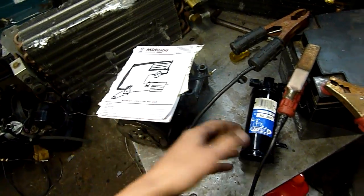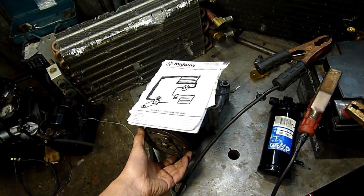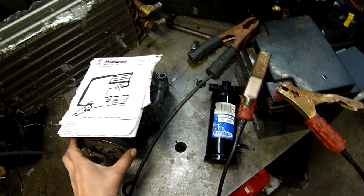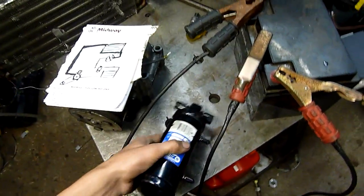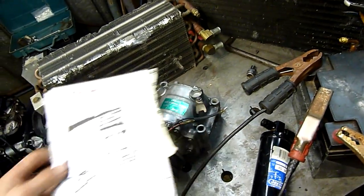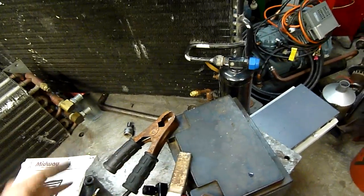It also picks up for surging and that sort of thing — you're not always running the compressor at a set speed. So there are a few little differences in how the system behaves; say in stop-start city traffic it's a little bit different to a normal refrigerant compressor running at a set motor speed all the time. But in reality this just makes up for it — you just add extra refrigerant. You might have a couple of kilos of refrigerant in the system instead of 800 grams in a window unit of the same capacity.